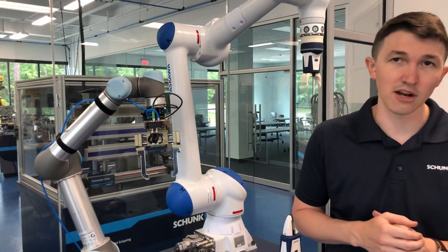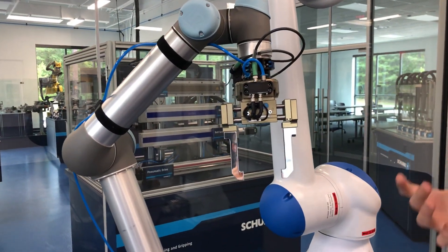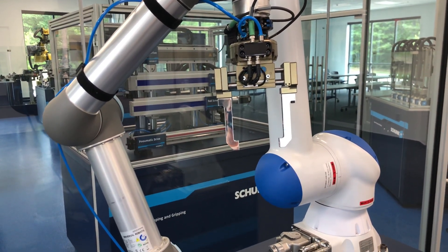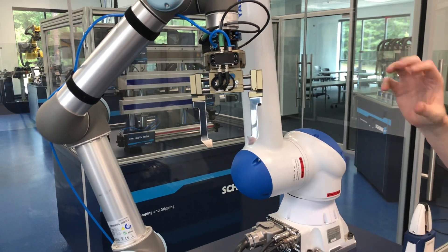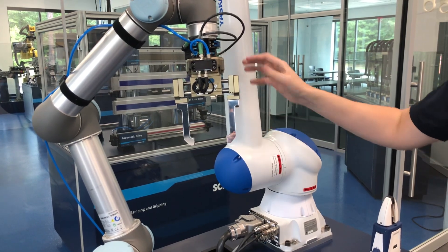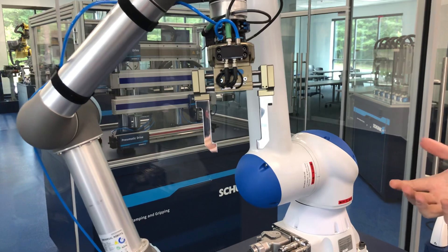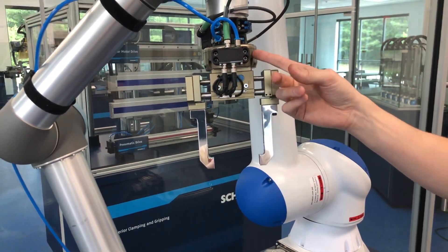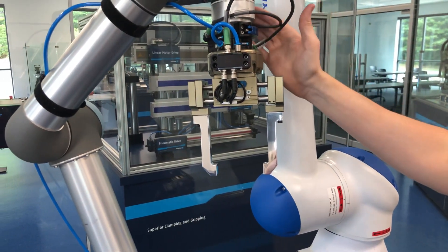I've got one here right now. This is our long stroke gripper. It's also IP67 sealed, so it's great for those applications where you need that longer stroke. What's kind of cool about it is we have the gripper and then we have our fingers. This little block right here actually has our valves in it. It also has our sensor I/O block. So our sensors plug directly into this, and we have one tube and one cable out, and this plugs directly into the end of arm.